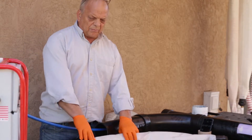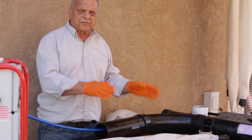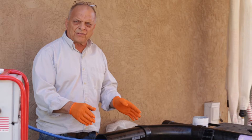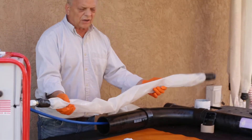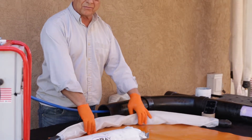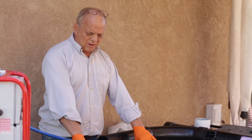You can do from 3-inch to 6-inch, and of course you can do 3-inch to 4-inch transitions and 4-inch to 6-inch transitions. We have different sized packers. They're traditionally 4 feet long on the 3-inch, 5 feet long on the 4-inch, and 5 feet long on the 6-inch — which means you can do up to a 4-foot repair on the packer.